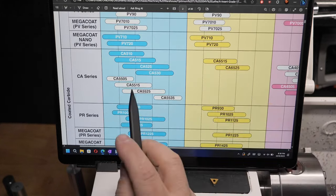And when you get down to brass and aluminium, it's fast again, 100. So that's 600 to 1250 RPM. What we're finding out here is that the lathe is actually designed to produce these results with typical tooling, typical materials, and typical speeds. Here, you're getting the right results. So there we go, that's the whole discussion around feeds and speeds.